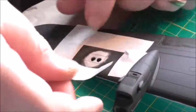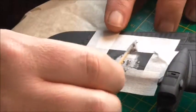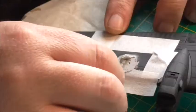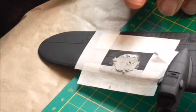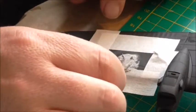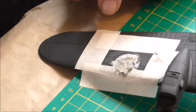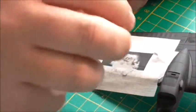So yeah, you can see I've got some there, but I'm just really protecting some of that. So I've got a little area there that I'm going to work with. So we kind of just fill it on. I am laying it on thick because there's quite a lot to fill here. And we'll use this card then to just smooth it off and just keep building it up like that. It's going to take a while to dry, mind, before I even think about putting another coat on. But the idea at this point is just to get it smoothed down as much as I can.